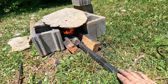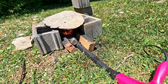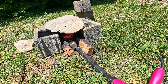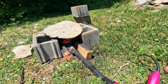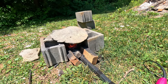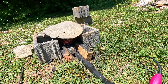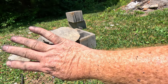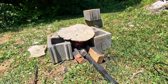What do you watch out for? Remember: no galvanized anything - pipe, metal, anything - nothing galvanized at all near the forge. The second thing: remember that when you use lump charcoal it's going to pop a little bit at the beginning. I assume that's because there's moisture inside the lump that's not all out, so when you start heating it, it vaporizes and pops off little pieces. They're a little hot when they hit you but it doesn't hurt anything serious. This forge is very, very hot though, so no fooling around.